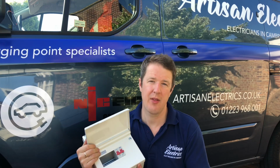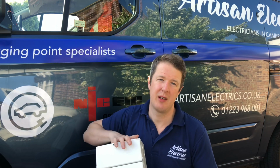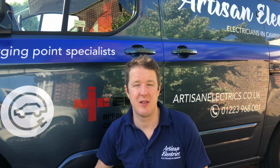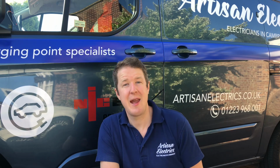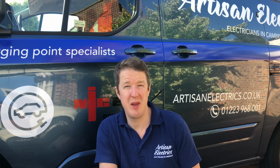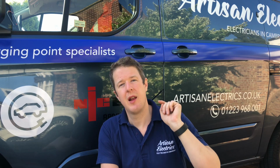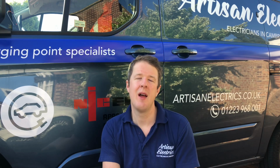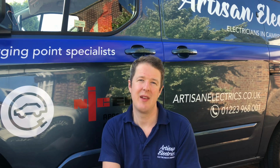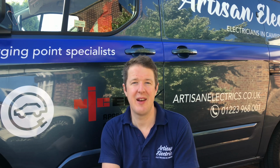So I've got my earth coming into this, and I'm also going to be running in the main bonding for the gas, because it's not been bonded currently. So it's going to be an armoured cable run from the consumer unit, which is in the middle of this bungalow, up into the loft, a little way through the loft, drop down into the garage, and then installing the charging point in the garage. So follow on the job and I'll let you know how it goes.